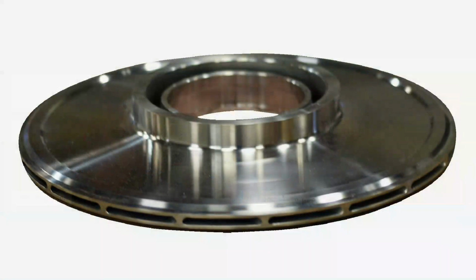And actually, there is a project right now where it turns out that Height Mapper was incredibly useful to get this to work. It's from a larger compressor company, and they threw some shrouded impellers at us that were quite large in diameter and very, very low on the downskin angle of the top shroud. Yeah, kind of like what you see here.